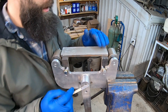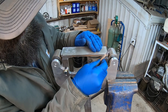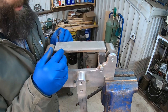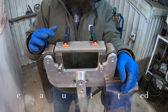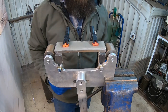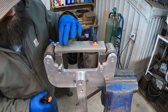We've got some excess squeezing out here — not really a big deal, but we need to scrape that off a bit so we can make sure the glass is lined up nicely. At this point the glass really is not going to go anywhere and it would be fine to sit it just like this, making sure everything's level. If you do bump it, it will still move side to side. I will have to adjust the platen position so the belt rides across the pulleys and platen more or less evenly — it can be a little proud, but not to this extent.